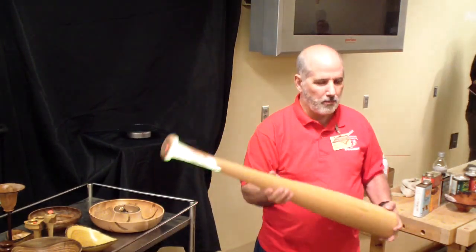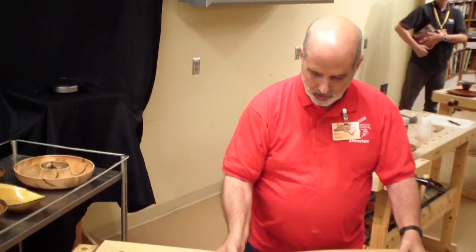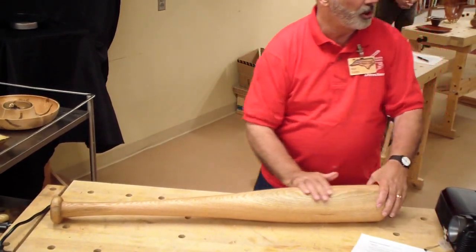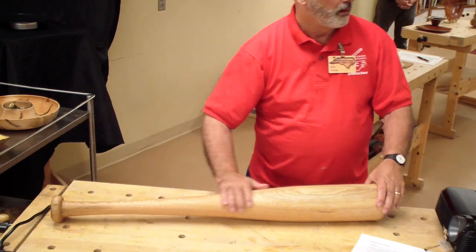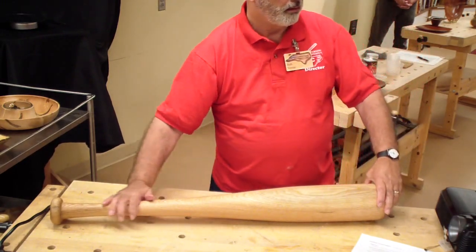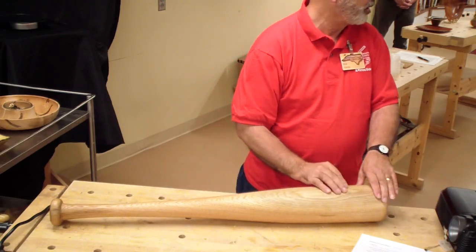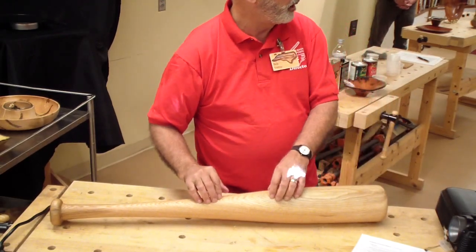One of the things I did mention about sanding is that you sand on the lathe. Yep. Well, the last thing you do is sand it again in the direction of the grain. Oh, yes. That hasn't been done. This is a CA finish. So because of that, you can still have grooves in the sand. They'll blend in with the grain and become invisible.